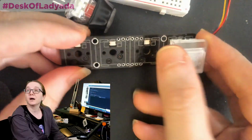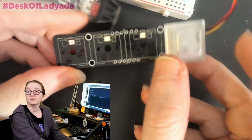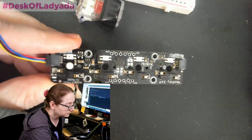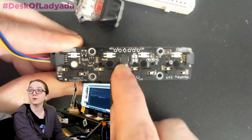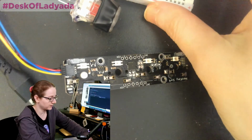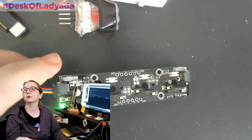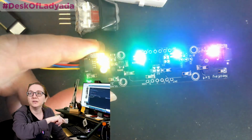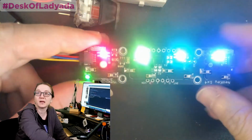Talking with some folks about maybe making it easy to add a bunch of keys using I2C. So we thought, okay, well maybe 4 keys is a good number, and this is a seesaw board. So this is using a SAMD09 as an I2C converter. Folks who know, we did a 4x4 NeoTrellis, an elastomer keypad with NeoPixels in it. So this is not too unusual. Instead of an elastomer keypad, we're just using mechanical keys.